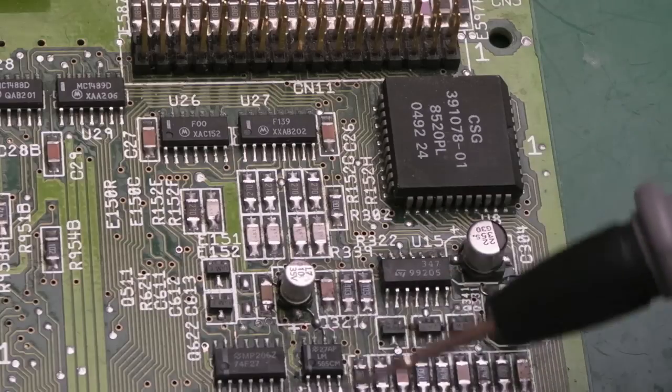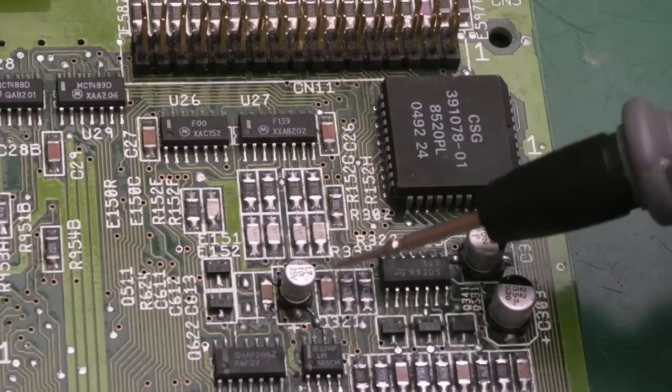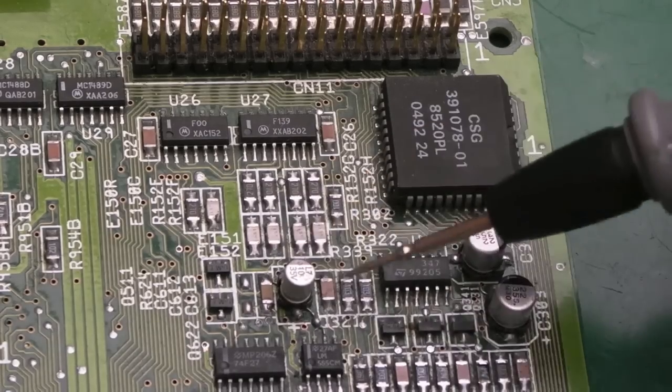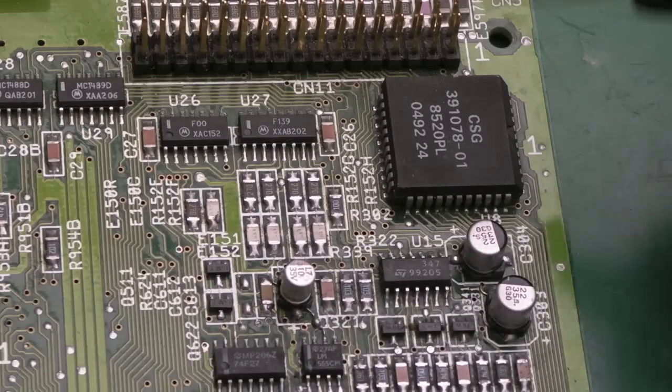before I do that, I'm going to go see if I can find schematics for this, because we can also see where these, if we can find the component designations of these, look them up on the schematics and see where they go. You know, should one side be ground, should it not be, should it be a coupling, or should it be decoupling across supply rails and things.